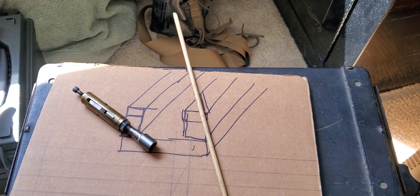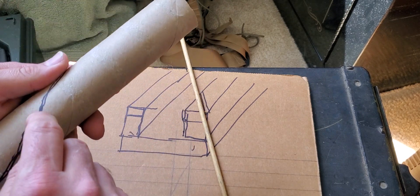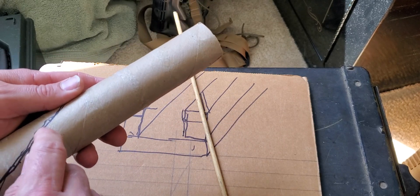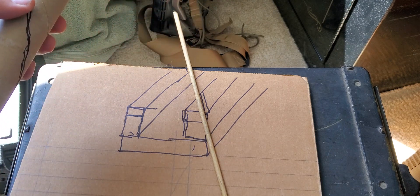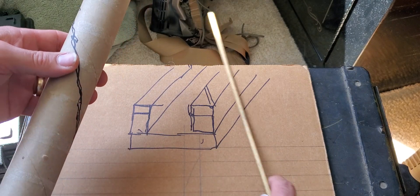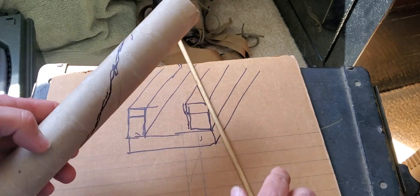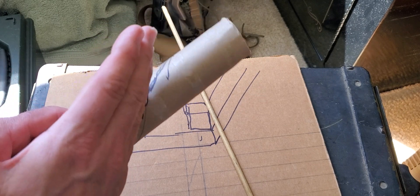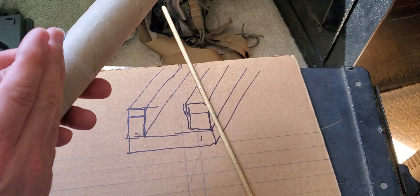Simple enough to cut a groove in there and to make that consistent. Your line - like this line isn't great, I would do it better if I had a solid piece and a helper, some other way to focus on this rather than making a video. But you can lay your rat tail in this groove, move the wood through, and any imperfections in the track get filed out as you go deeper. It becomes a very consistent twist rate.